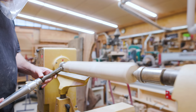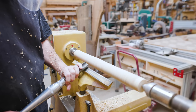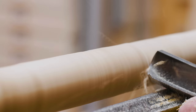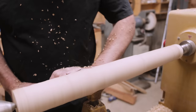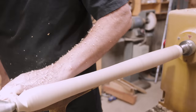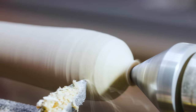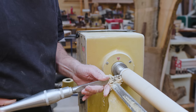I used my big gouge to do most of the work on these — it's good for removing a lot of material, and if you hold it at a nice angle, it gives a pretty nice finish too. I didn't bother cutting the corners down before putting it on the lathe, but it went pretty fast. I just kind of guessed at a shape for the handle — I left it a little thicker where the wrench is and brought it in a little narrower where the hand will go. I got it round first and then started finding the shape, opened the ends a little bit, took down the little scrap piece, and did a little final surface work with the scraper. Made sure the width was going to be good and worked on the wrench end.